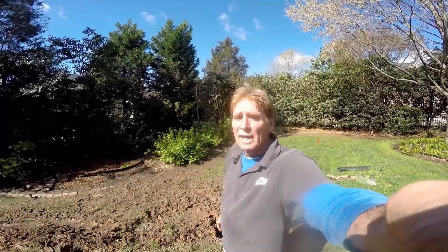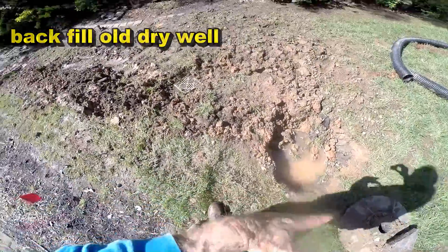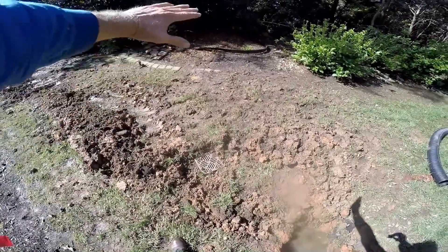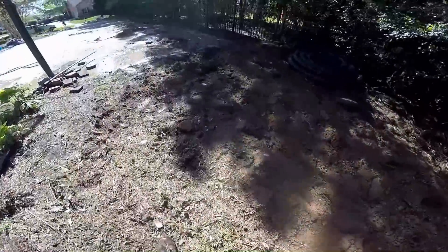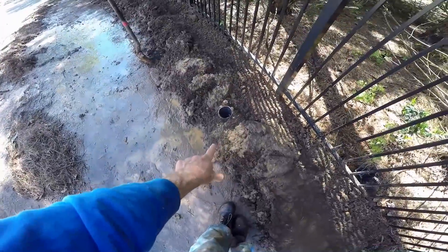So we've got everything installed, covering up, really close to finishing. We're going to fill up this old dry well — get rid of that, it's just gone. Got a catch basin here; we're going to put our excess soil back in the back there and let it grade over to our system. Got another catch basin over here — same thing — put some soil behind here and let it grade into our system. The line goes rather deep as it comes around this corner. There are a lot of old trees here. We're going to put a small catch basin right here, cut that off and put a grade on it — that's just giving us access to the line.